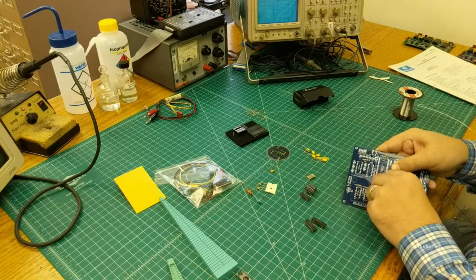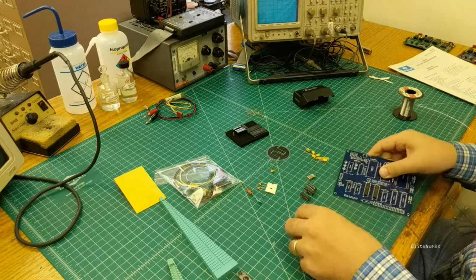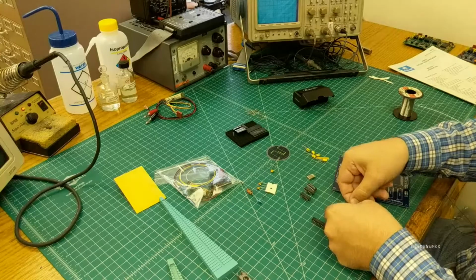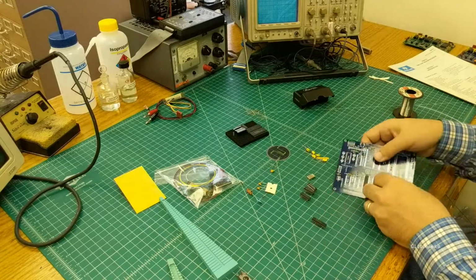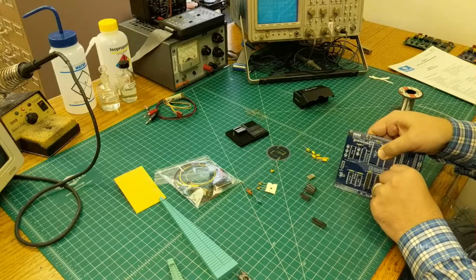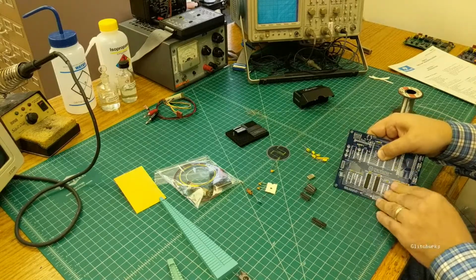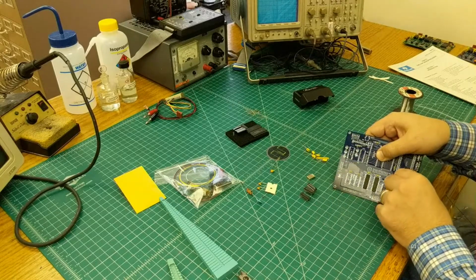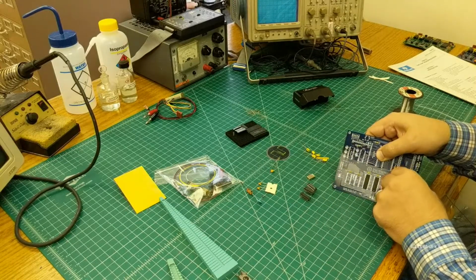These have some spring in them where they've just come out of IC tubes, so you may find it easier to sort of flip the thing over and roll the pins a little bit on the desk. You can also leave the spring in them and just push it in with your thumbnail and get them into the hole. If you leave the spring in them, they stay in the holes in the board without solder, so you can flip it over and get to it that way.